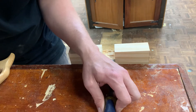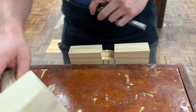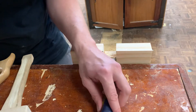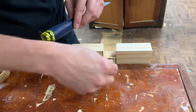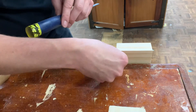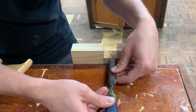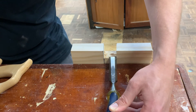I'm not reefing the chisel up — I'm bringing it back and going back down again, just trimming that ever so lightly. Once I've cut in a bit I'm going to come back through from the other direction. I'm not even going straight to the line; I'm coming a little bit higher up to take a little bit out, because sometimes it can grab and rip out more timber than required. You're going to put it on that line and chisel out. Take a little bit of time, and never ever chisel towards you because you will slip and you will get your hand.